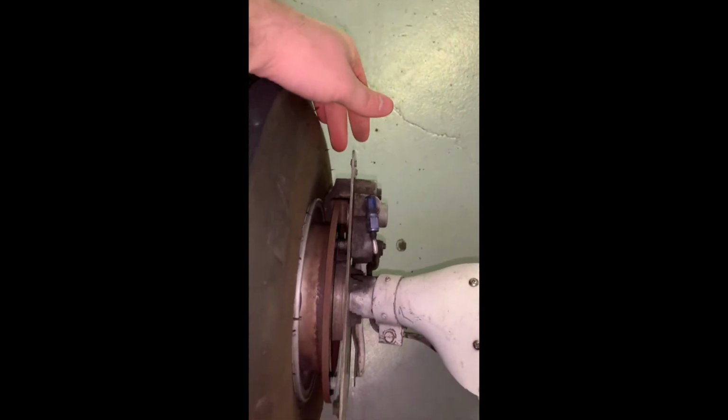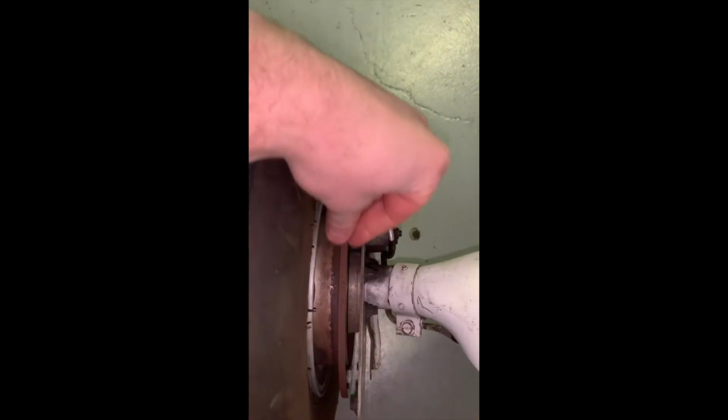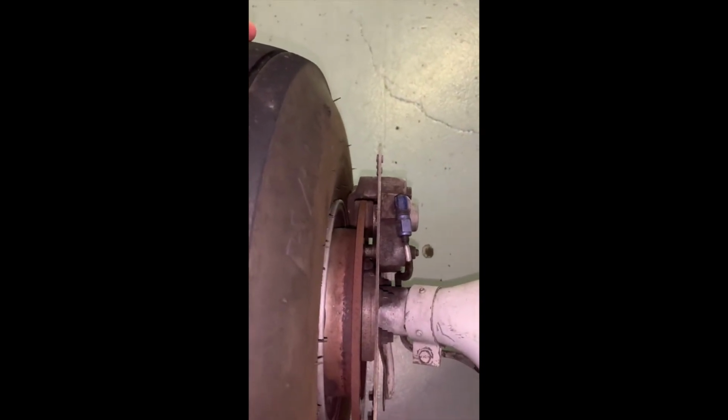I always like to start right on the pilot side here, so I'm just going to close the door. And we're gonna start right here with the landing gear. So we can take a look down the landing gear, make sure that there's no damage there. We wanna check these screws, make sure that they're tight. Moving down to your brakes, you can actually get a look at your brake pads left and right of the disc here, and take a look at the brake disc. We got lots of brakes there, lots of discs, nothing looks unusual.